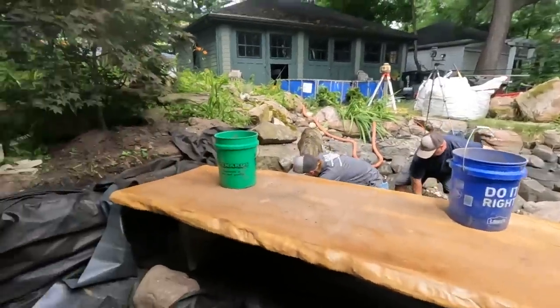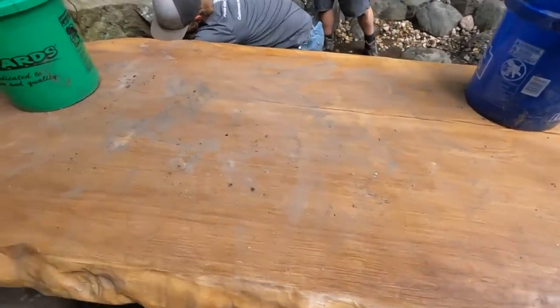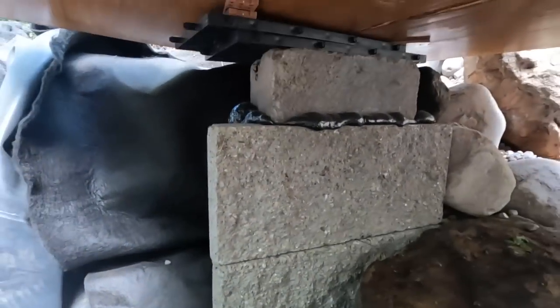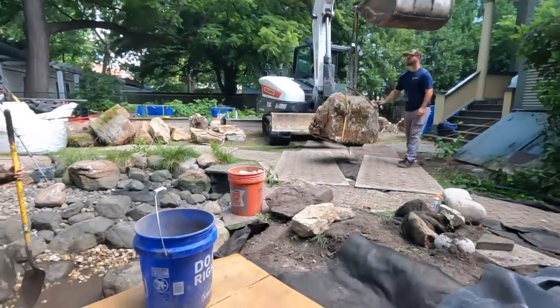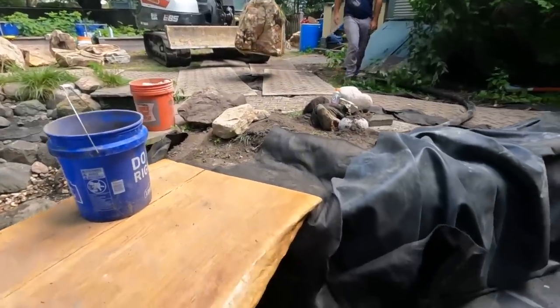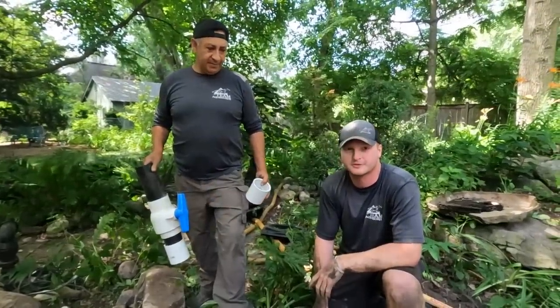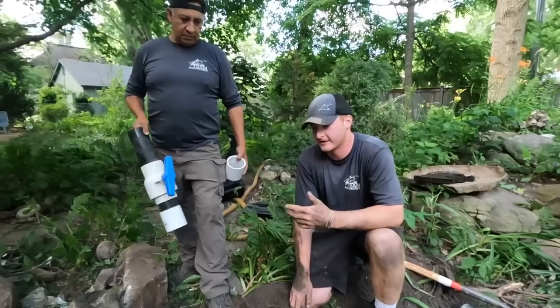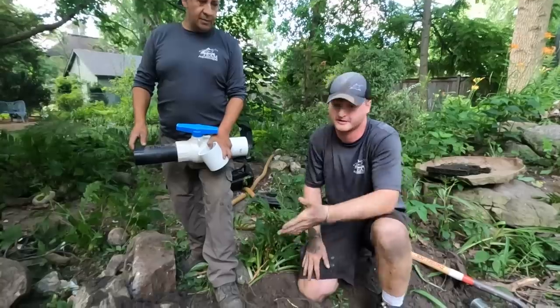Things are happening — we went with the bridge. Thank goodness, because it totally would have looked weird to have a little crossing coming across here. Chris and Zach are over here buttoning all this up. We ended up using some structural wall block and bridging our way up, and we have some aqua block panels to lock everything together underneath to keep it from rocking back and forth. Juan's got our next big frame rock — it's going to frame out this bridge. JD and Luis are adding a three inch ball valve to the wetland so we're able to adjust the flow coming off the top waterfalls, and also when servicing the pump we can just close that ball valve and do the pump without all the back pressure coming back pouring into the pond.